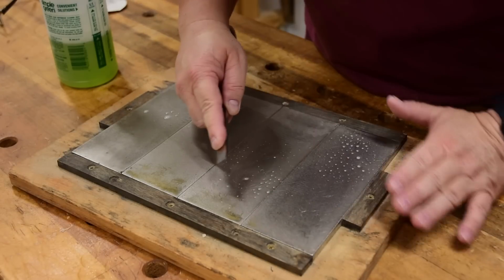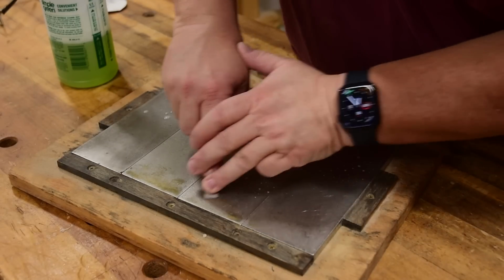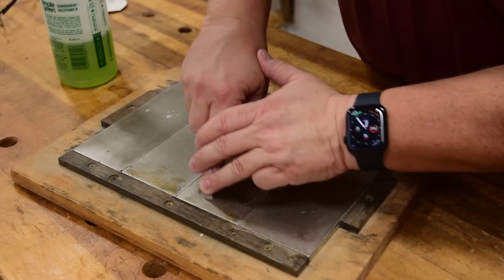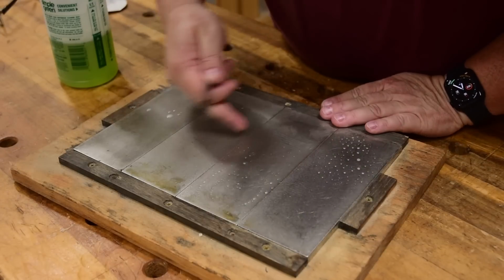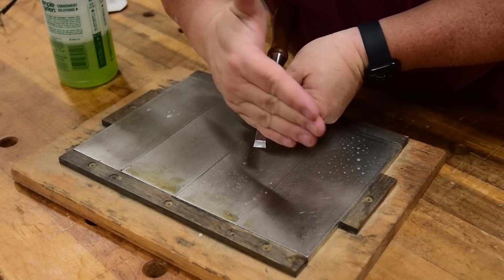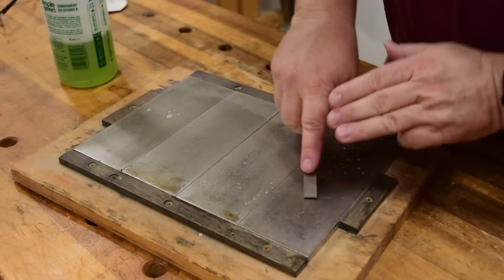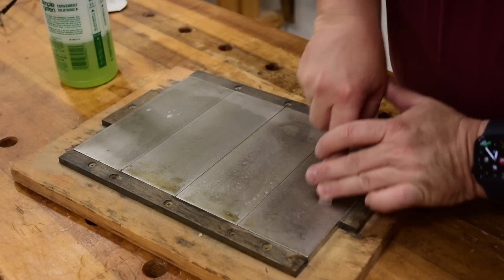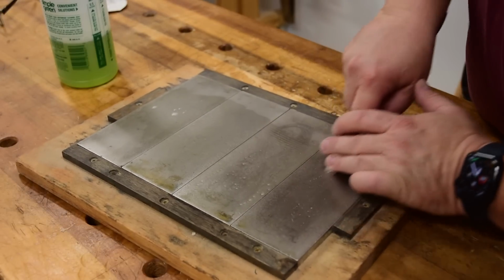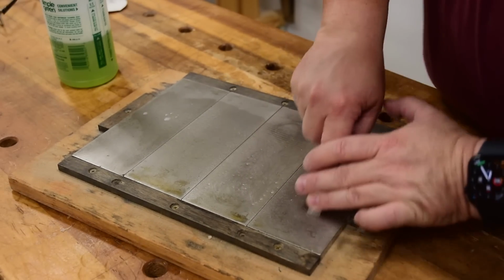I can do circles. And this used to be something that with the old oil stone sharpeners, they would come over and do a circle here, a circle there, then they would do a figure 8, and all that kind of stuff. Their goal was to even the wear over the entire stone. What it was, they were constantly crossing over their hatch pattern. So they actually got a better edge that way. It wasn't serrated, it was just going all over the place. So that is the one advantage of using a freehanding technique every now and then, is you can be a lot more efficient because of better use of the hatch pattern.